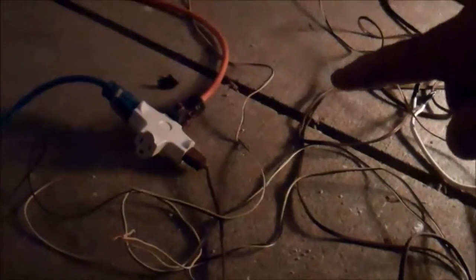If you look down here I'll show you exactly how this switch works. We have a 12-volt power supply as our substitute for batteries. One line of the power supply goes into the relay switch. The other line goes into the switchboard here that I have my foot on — into one plate. The other wire is attached to the top plate and goes back into the relay switch. For 120 AC, a sacrificial extension cord is plugged into one half of the relay. The other — normally open — goes back out into our second sacrificial extension cord, into this lamp. The whole point: this is a pressure switch. When somebody's standing on it, we have light. I take my foot off — no light.